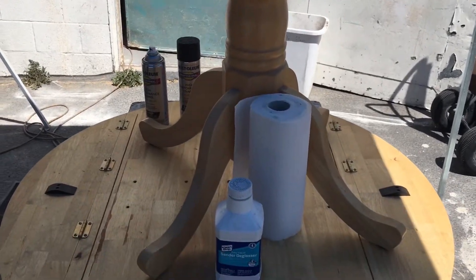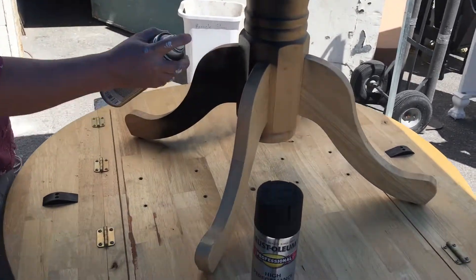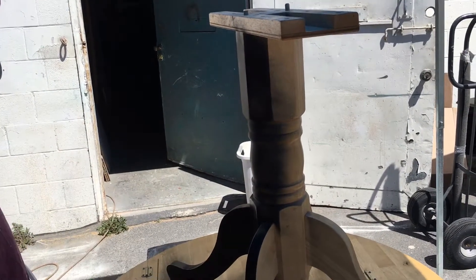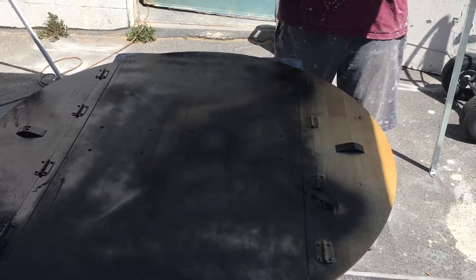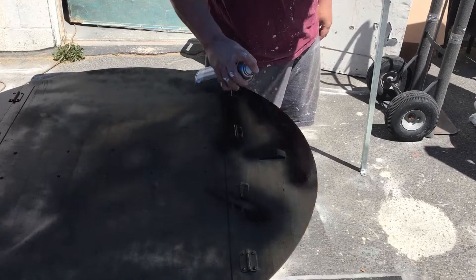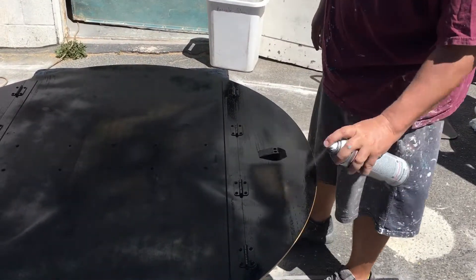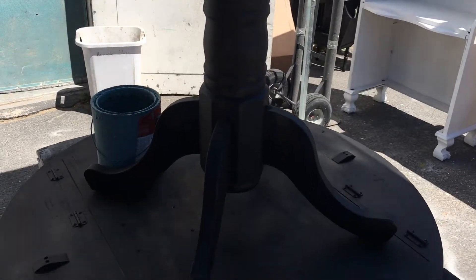Once it's clean, we're going to apply a coat of black spray paint as the undercoat — flat black, this is the brand we use. We spray the underside of the table as well, just to give it a more finished appearance when we're done. Particularly the leaves, when they're folded down, you can see the natural wood underneath if you've forgotten to paint those. Then when this dries we flip it over and spray paint the top.